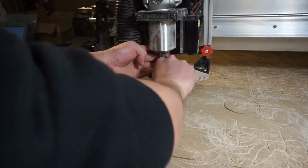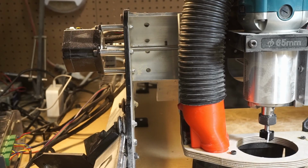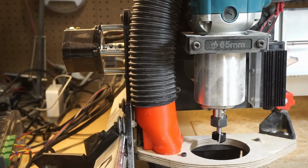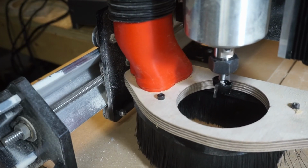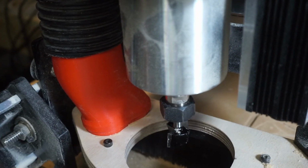All right, let's get the machine set up. First of all, we'll make sure to set up the 0 point for the CNC machine. Let's start off by jogging the x-axis all the way to the left. You can watch the side of the x-axis until it's close to the y-axis, and I recommend leaving about ½ inch of wiggle room. Next, we'll move the machine all the way to the front, and again, make sure you have about ½ inch of space from the front foot.